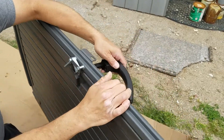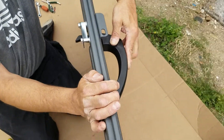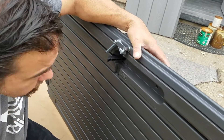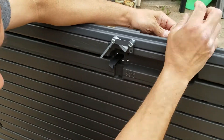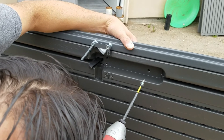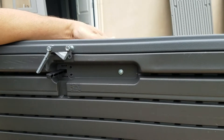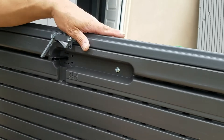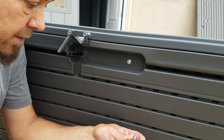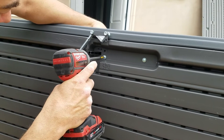It needs to move the way you just saw me moving it back and forth. If it's a little rough, you want to make it so it's not so rough, because there's a spring that's going to pull it back down. It gets inserted through the right-hand door just as you see there, and it's going to get a little plastic attachment for that metal piece to go up against. I put the door handle on first — I always put this screw first and just leave it a little bit loose so I can line up the two holes towards the top. There are two more holes on the top of the handle that are going to get two more screws with washers. You want that little bit of play so you can line them up perfectly in the preset holes.